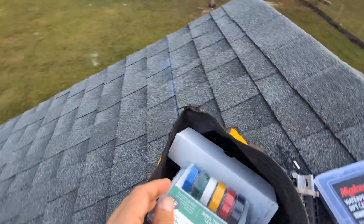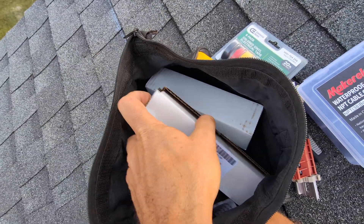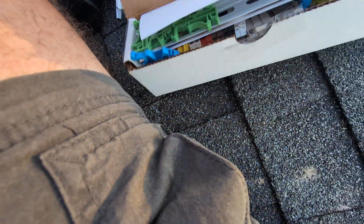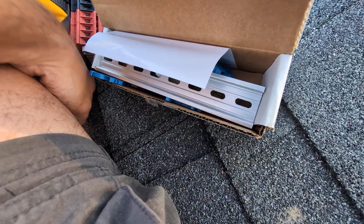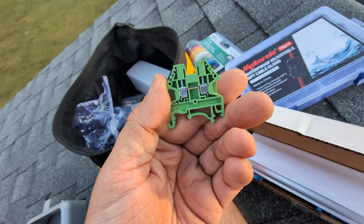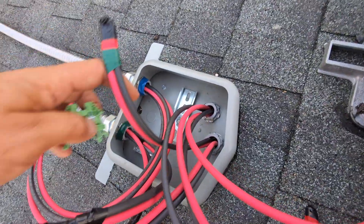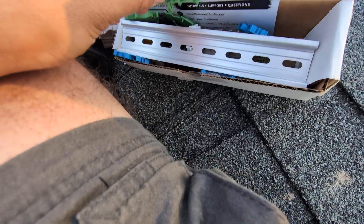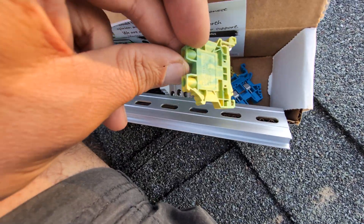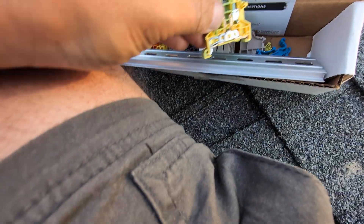I did order these color-coded DIN rail connectors, and I was really hopeful they'd accommodate my wire, but they're just a hair too small. I don't want to go underpowered or compromise safety. These junctions use a set screw to combine two wires — one goes in each side and they clip into the rail. This piece already has the rail built in. They also shouldn't have used green here, because there's a protective earth — PE — indicated by green-yellow, which is slightly different. That taller one grounds downward and would bond to this ground connection.